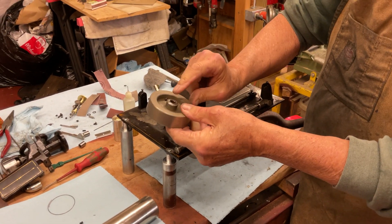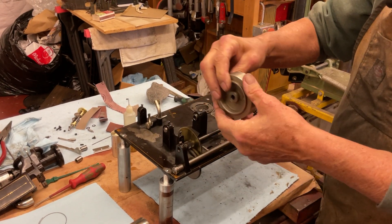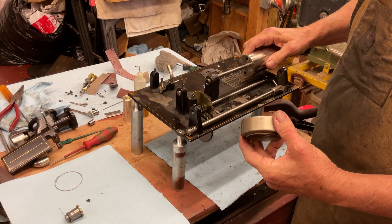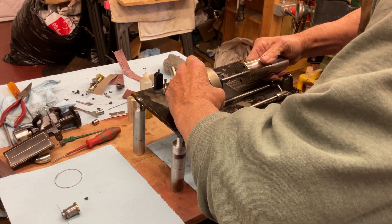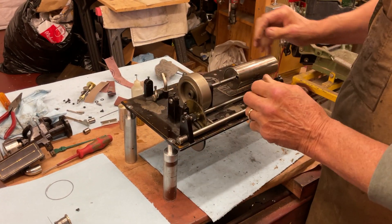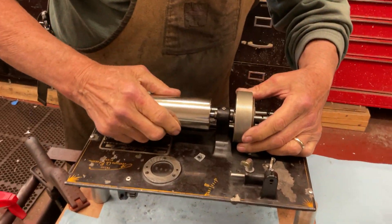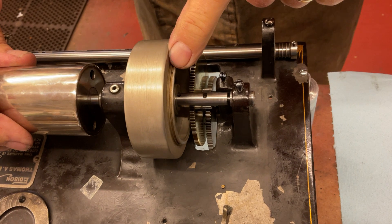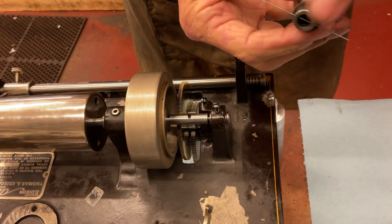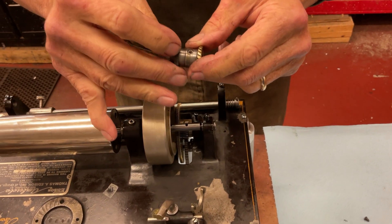It goes on this way. You have to polish this out because it runs right next to this bearing right here, so this is all running together. You slide the mandrel shaft in and then it's going to come through. You have to line this hole for the wire, and the wire is going to go through the governor drive piece that runs off the mandrel shaft. So you're going to have wire — this all has to line up and then the wire comes in place.